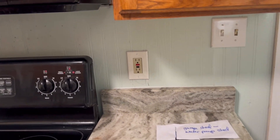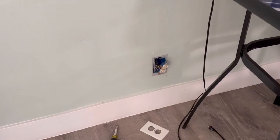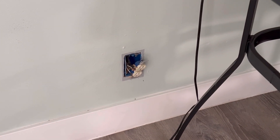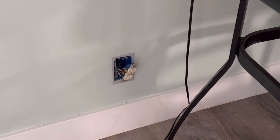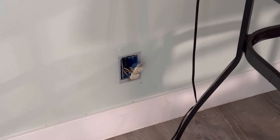If you've got an older house that may be ungrounded, that's something you definitely want to take a look at and make sure there are no bootleg grounds. Two options: add a ground to the system, or put GFCIs everywhere. There are maybe 12 to 15 receptacles in this house that need to be GFCI'd.